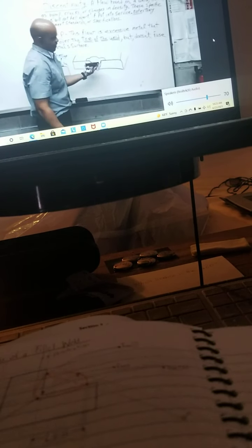You have a groove. Now, they're going to do the DOT test this Saturday, I probably have to come in, but I don't know. If you do this in the flat position, you get disqualified, because you have to do it in the vertical position. It's supposed to be like this when you weld it, vertical, going up. So what you're seeing is in the flat position.